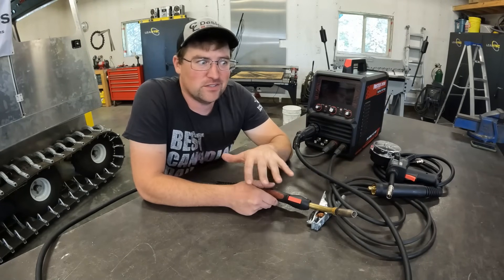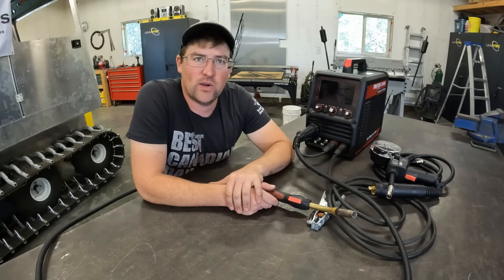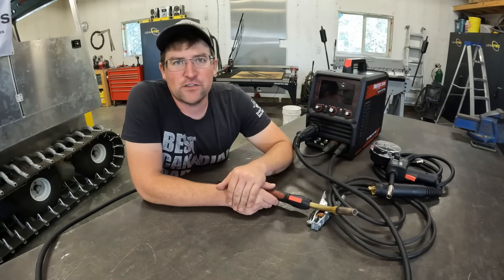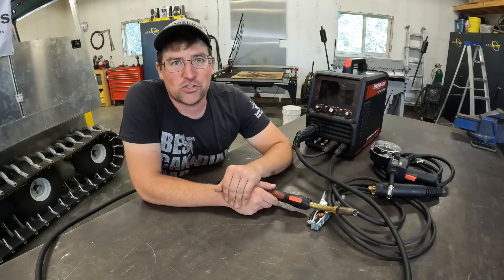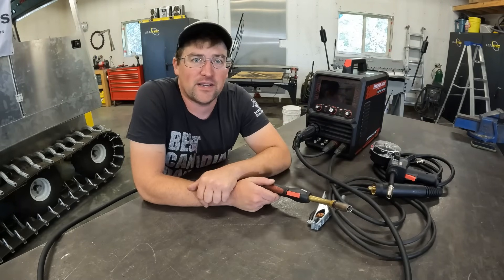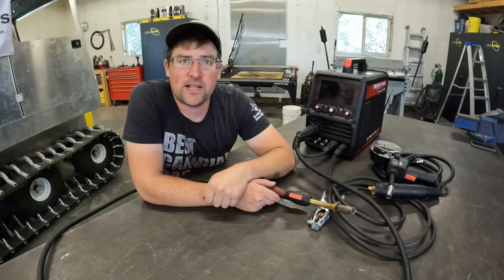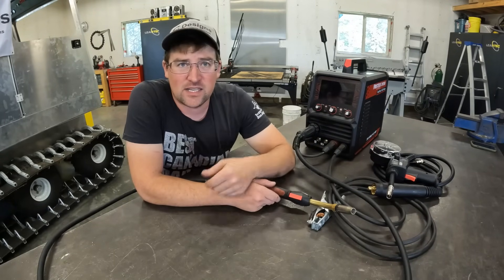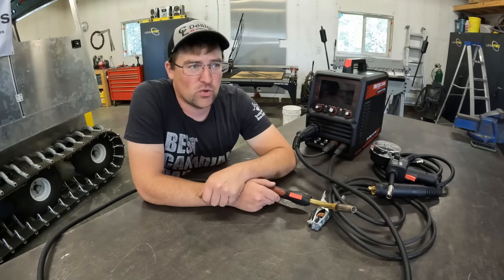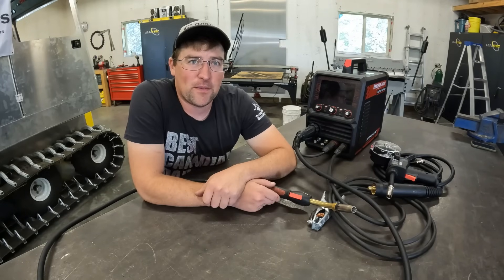I don't really plan on doing a full welding tutorial video — I really just want to cover the aspects of dual pulse MIG welding, but let's start at the basics and make sure everyone's up to speed. You have different types of transfer mode in MIG welding. Short circuit transfer is definitely the most common, and that's where the filler metal coming out of your MIG gun touches your base metal, arcs out, burns back, hits again, and keeps repeating that process. It can create a lot of spatter, there's a risk of cold joints when welding steel, and it's just not the best out there.